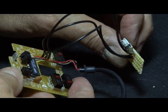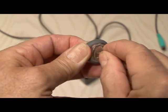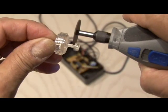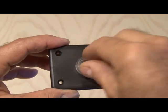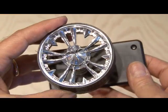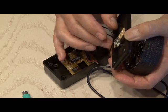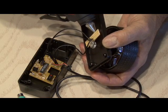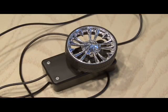Pay attention to which wire goes where so that it works properly. I decided to use the scroll wheel spindle as our axle between the encoder and our new RC wheel, so I cut off one end of it and drilled a hole in the top of our hobby box. That'll go through the hobby box, and then the RC wheel will be glued to the spindle. The encoder will attach to the other end of the spindle, and then using some hot glue, we'll secure the small circuit board in place on the hobby box top. The last step is to cut out a small notch for the cable and seal the box up.